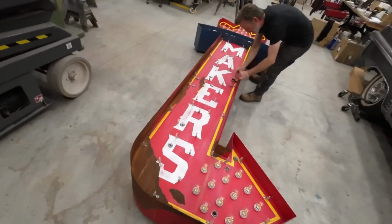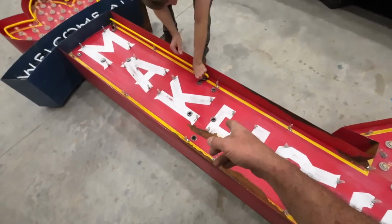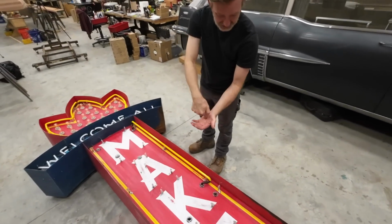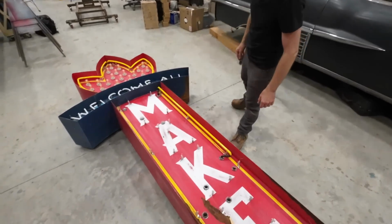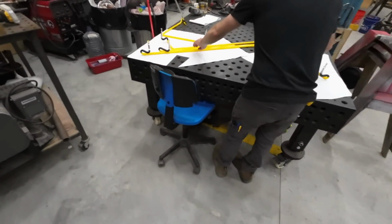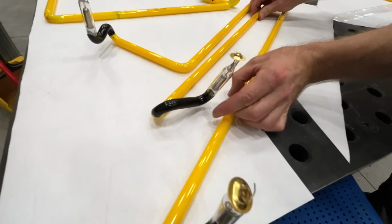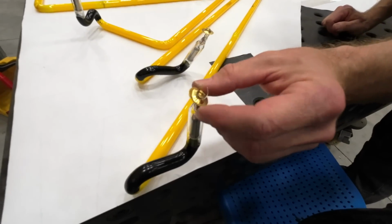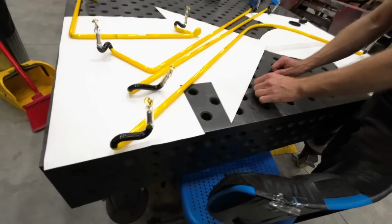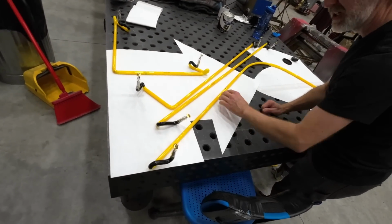So when you place the neon in, it's just the physical connection of the electrodes being near the spring inside the cup. Yeah, it touches the spring, compresses that spring, and that creates the connection. And the electrode is just a couple little bits of wire sticking through. Oh yeah, I see you have these, those were added recently, right? Yeah, they're called buttons. You can go without them and just kind of twist the wire up in there, but it tends to hook on the spring. Oh, this gives it some better contact. Yeah, it makes a better connection.